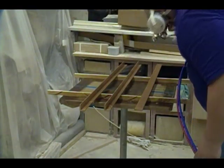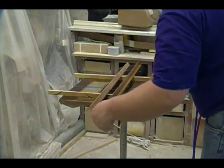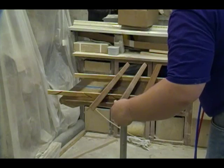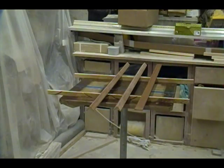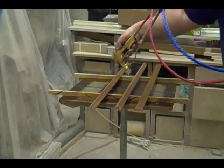The outside edges of these two corner moldings actually get seen, so I had to spray those first. By the time I flip them over and spray the surface, there's very little contact on that outside edge, so this method is pretty effective.